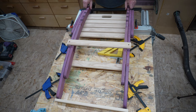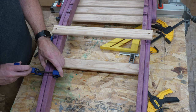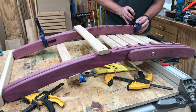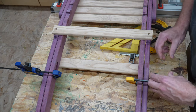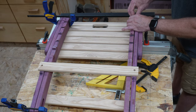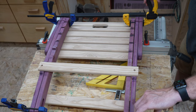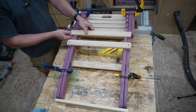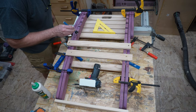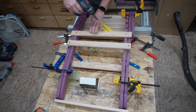Then with the assembled back upside down on the table, the seat section is assembled in its nested state. The seat supports slide into the back and are clamped to the back sides with a couple of spacers — in my case I used four finish nails, which will result in about an eighth inch of wiggle room between the seat and the back when nesting the chair. Make sure the seat sides are clamped parallel to the back sides and an even distance from the ends, and make sure the clamps are not so tight that they bow the side pieces or cause the spacers to make an impression in the legs — just enough to keep things in place. Then the seat slats are installed in the exact same way, with that same quarter inch overhang on each side of the back assembly. Pre-drill the slats on the drill press and then drill pilot holes into the seat legs and secure with glue and screws.